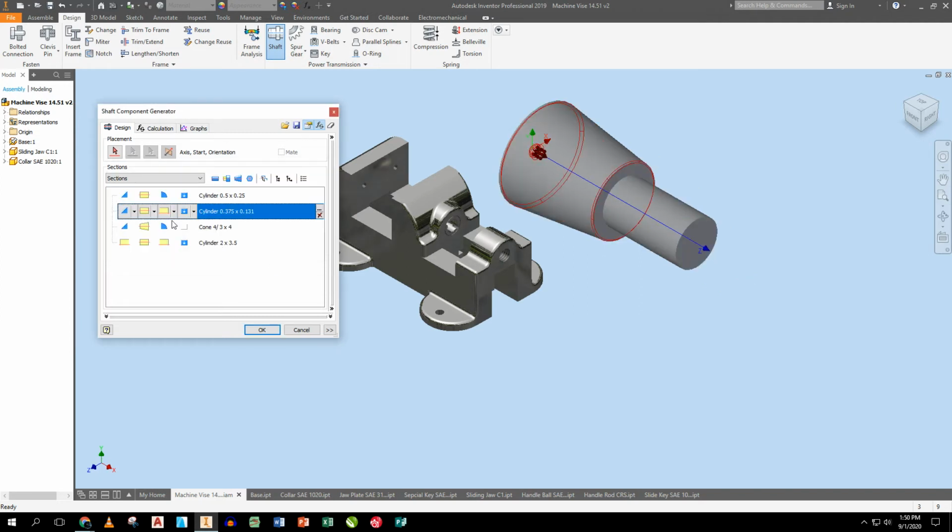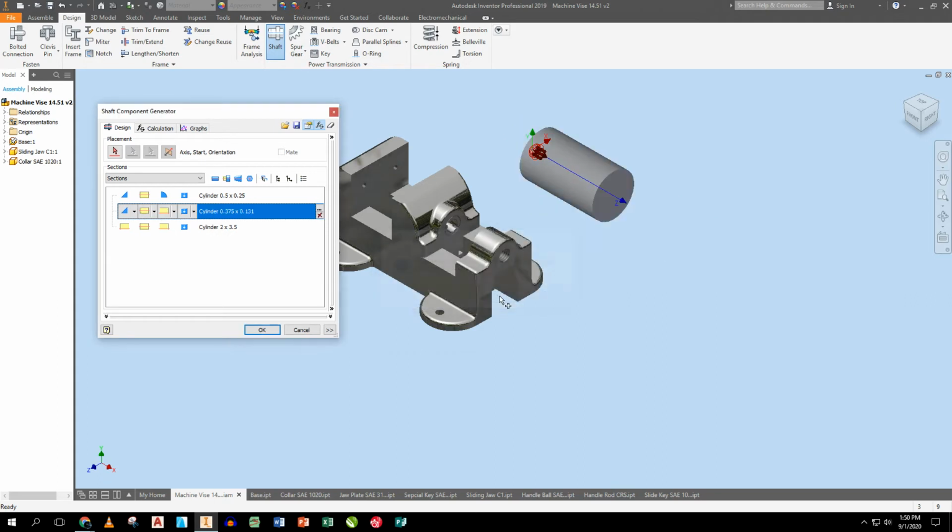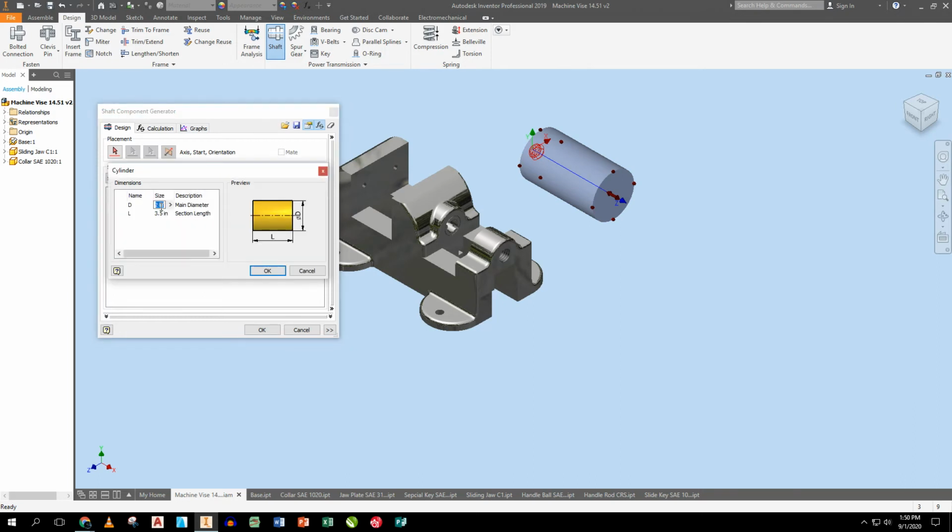Okay. Now, this cone doesn't exist in ours. So I'm actually going to hit the delete button right there. Yeah, I know, we're going to get rid of it. This next piece of shaft right here, I'm going to edit it out. It is, again, 0.5 in diameter. And when I did the math, because this is where the slop's taken out in our design, this comes out to 1 inch, and if you actually do the math, it's 1 1,000th of an inch. So just to get it dead on right with the numbers I have. It wouldn't really be that in real life. It'd be 1 inch or whatever, but that'll get me there.